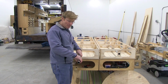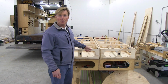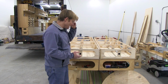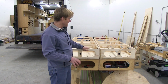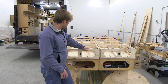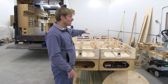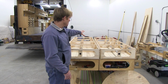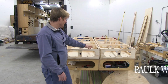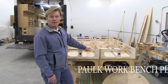So the pipes are mounted for the table saw. I will do the final part of the table saw, creating the permanent mounts that go on the table saw, at the very end after the bottoms are on and I have the table set up on the sawhorses. For now, there's a little more detailing to do. I'm going to be putting some backing in for the router plate as well as for the tracks for the miter gauges and get that detailing done. And then we'll button it up after that.